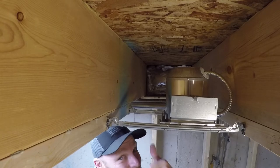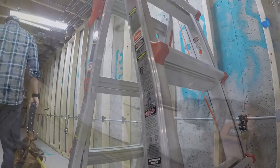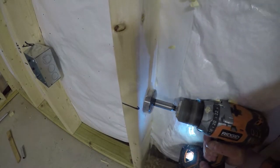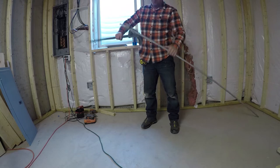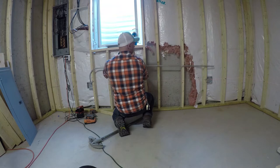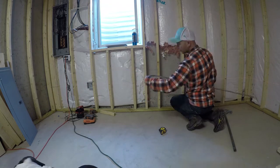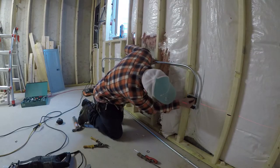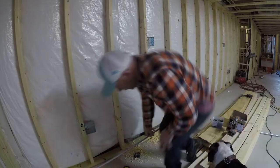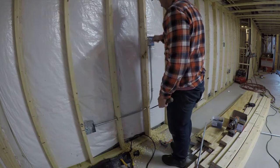You can use the nail they provide on the extension arms or just a drywall screw like I did. Now the hard work begins — at least for me. I used a 1.5-inch Forstner bit to drill all my 2x4s, making sure to stay at least an inch and a half from the edge where the drywall is going to be installed. Installing the conduit is not as easy as it looks — I've seen electricians breeze through this, but for me it was a little more difficult trying to figure out the angles and where to bend the pipe.